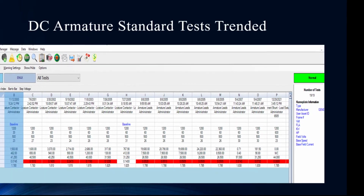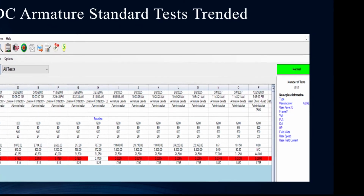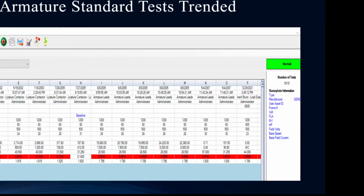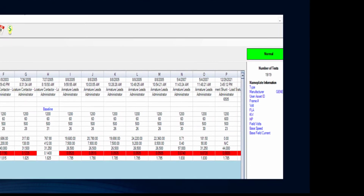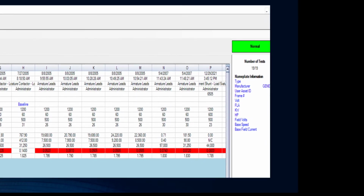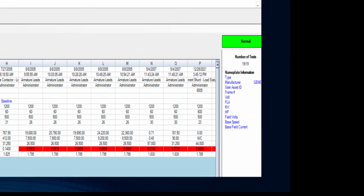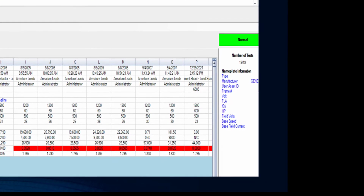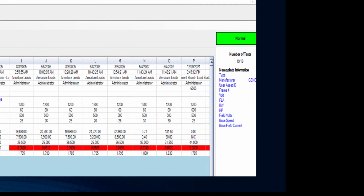Yeah, and this is very common with DC armatures. There's a lot of carbon dust floating around. On our submarine, it was very normal for us to get into our 300 kW motor generators weekly and blow low pressure air to remove that carbon dust. My guess is that the 0.7 megohms in the 2007 measurement was exactly that. They were able to identify it and raise the value to an acceptable, over 100 meg. Yeah, and they may have blown it out, whatever the situation was, to get it cleaned, and then they brought it back into operation again.